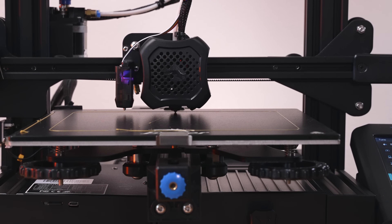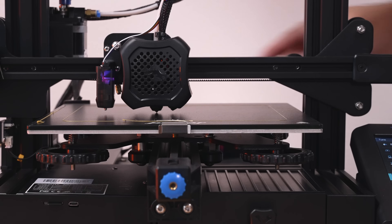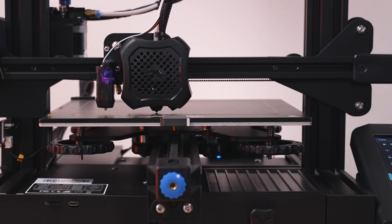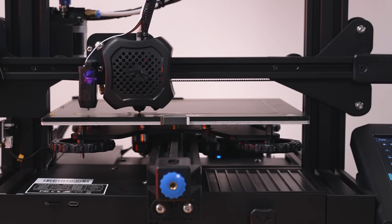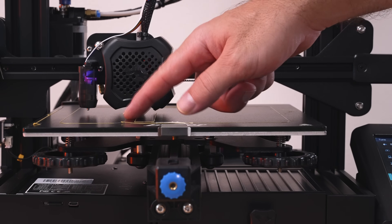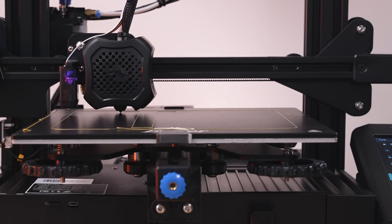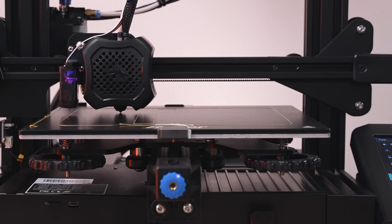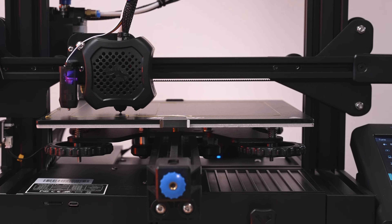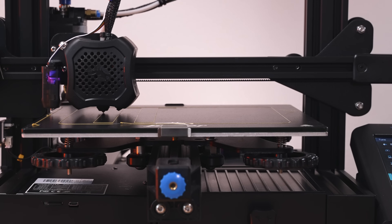It's finding where to start and it's actually perfect — it's stuck on perfectly. We got it on the first shot. The Z offset is working well; if you need to get a little closer you can adjust further. For mine, 2.06mm might be the sweet spot.